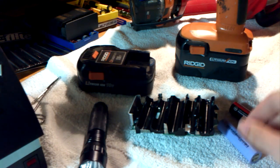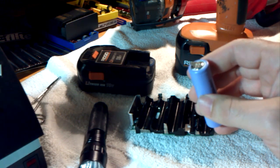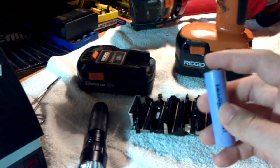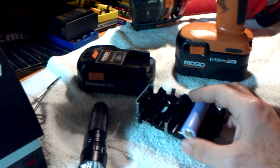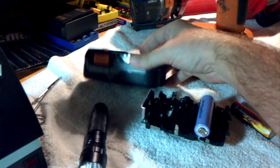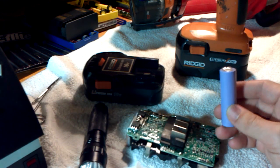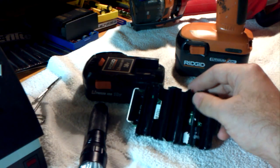They use some kind of special spot-welding technique, or maybe they weld the tabs on prior to putting the chemicals inside the cell. But you can buy these pre-tabbed, so you must buy that version and then you can solder them together. Yes, you can buy these 18650 cells in the unprotected versions, because you've already got the protection built into the battery pack board. You can buy lithium ion cells for probably a couple bucks a pop, solder in new ones to replace the old ones, and be good to go.